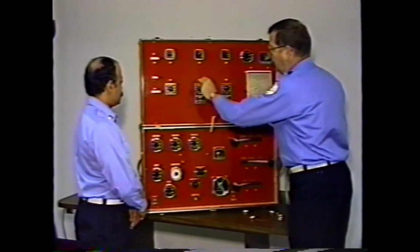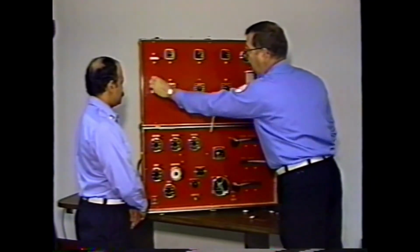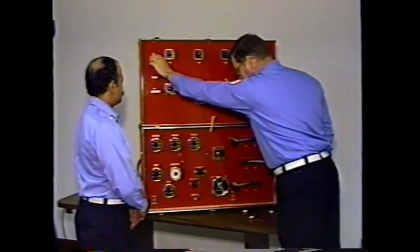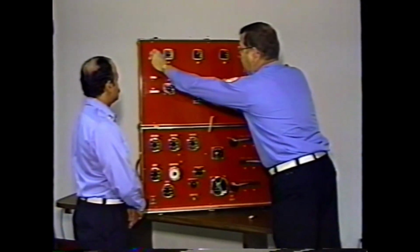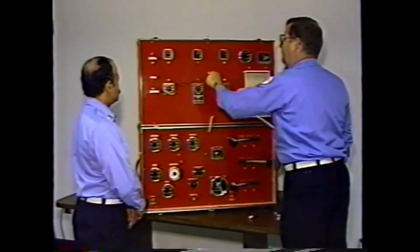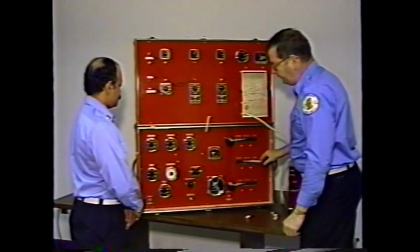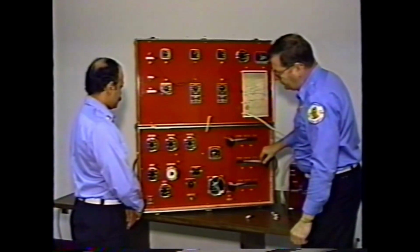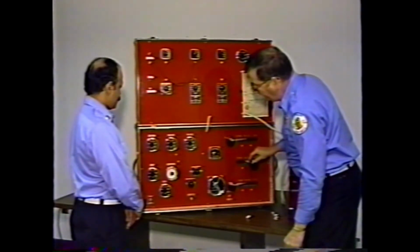To operate the other features of this simulator, such as the elevation, you simply come out of a hose lay, in this case a 2.5 inch hose lay, into the bottom of a ladder, and this is a 60-foot ladder we're simulating. Come out of the top of the ladder and go into a nozzle selector. In this case, we have put in a 1-inch nozzle. To operate this system, you open up your discharge line and you adjust it to approximately 180 psi.